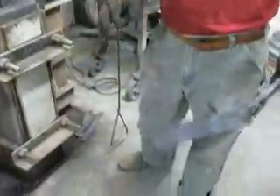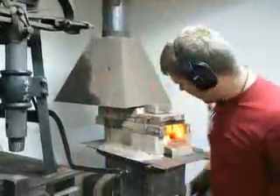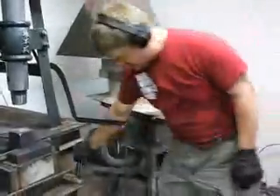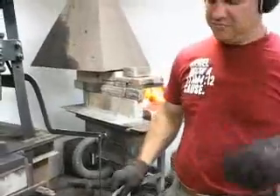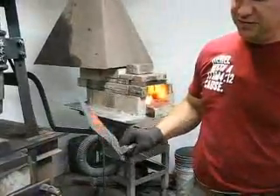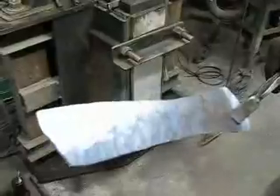These last hammers — I wasn't trying to move the steel, I was just trying to straighten it out. You don't want to be really hammering hard once it cools, once you can't see any red. If I held this in the darkness you'd still be able to see a little bit of red, but pretty much just at the end. The one time my tongs got away from me I hit it on the side — it's still thick enough that it doesn't matter, but that's what you want to avoid.